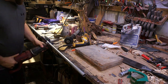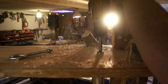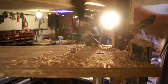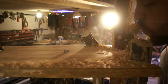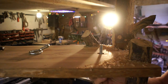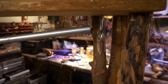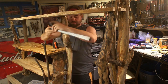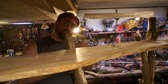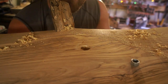One thing the customer wanted was a place to hang shirts and merchandise, so I'm making a rack they can hang stuff on. Since she mentioned not knowing if they'd keep it, I wanted to make it removable without looking too unsightly. To that end I'm countersinking the top so if the rack is removed you'll still see the hole in the bottom but it shouldn't be too big or noticeable. With everything being so organic and curvy, placement was tricky — I put the bar in, saw where it looked right, traced around it, drilled a small hole through the middle of that mark as a reference on top, then countersank it so the bolt sits flush and drilled through for the eye bolt.